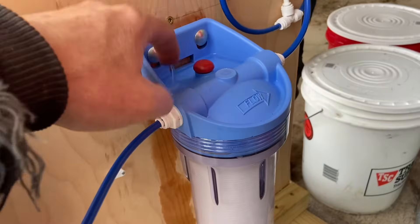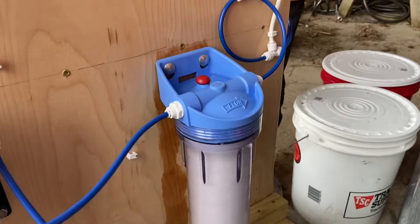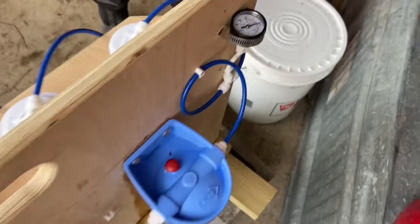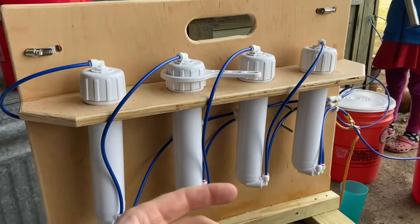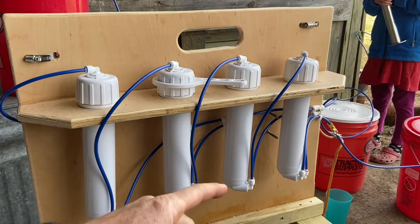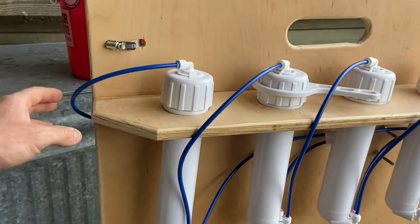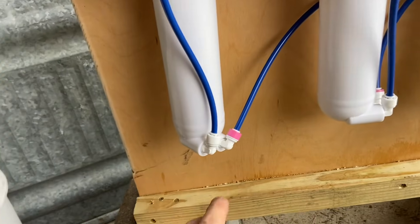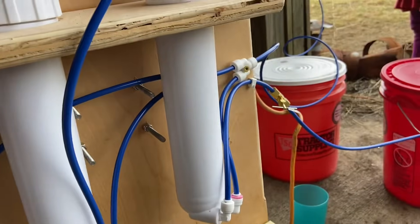From the pump we run to a pre-filter. It gets a little messy back here because you bleed the air off initially. There's a 5-micron filter in here — I'll link to all this. The pressure gauge shows we're running right at about 100 psi. On these RO filters, you can run them in parallel or in series. For recirculation, you'd run them all going in the top and out the bottom and keep recirculating. This line here is coming in from that 5-micron pre-filter, in through the top and out through the bottom.